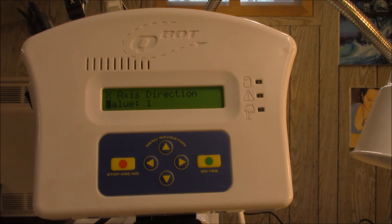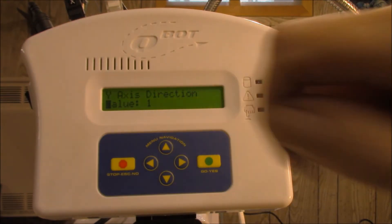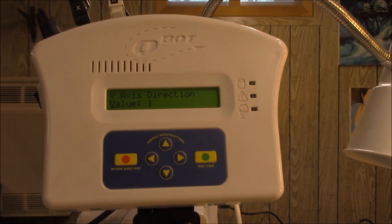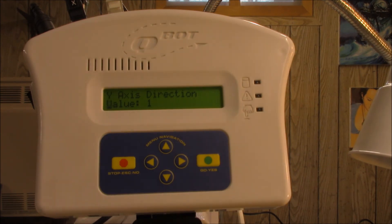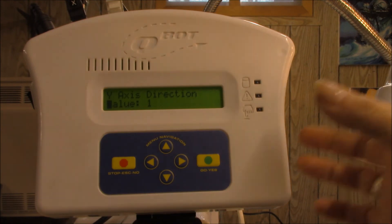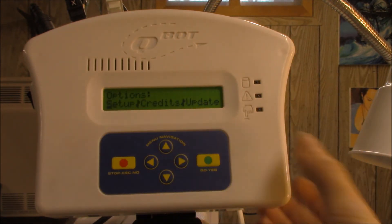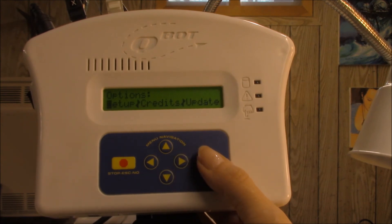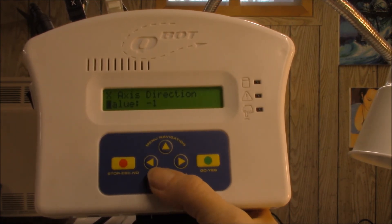It's not going to break it — it is just going to correct the programming in this system. Also, if you press the down arrow once, it asks you Y-axis direction and the value is one. Similarly, if your problem is with the forward and backward movement of the machine, change this to negative one from one, or the opposite. You're just telling it to think on the other side of the line. Any changes you make have to be followed up with the Go button. It says settings saved and brings you back up to settings. If you want to change more than one thing — say it's not working in front-to-back or left-to-right movement — you'd have to go back to Setup and find the relevant setting. On my machine, the correct settings are X-axis negative one and Y-axis one.